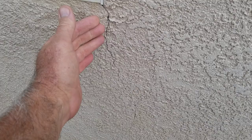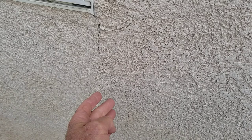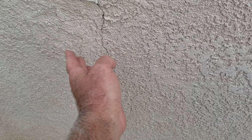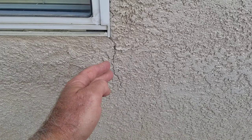All right, let's caulk some cracks. I'm going to show you how I do it. Some guys will go out and dig out the crack, fill it with stucco, and rematch it. I don't normally do that. I'm going to explain to you why, because the important thing is you need to know why you're doing what you're doing. Some guys just dig it all the way out, fill it with stucco, make it look perfect, and fog coat the wall with plastering stuff — that's a temporary repair.